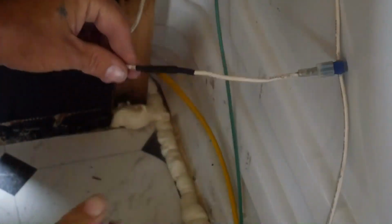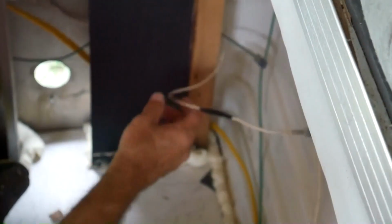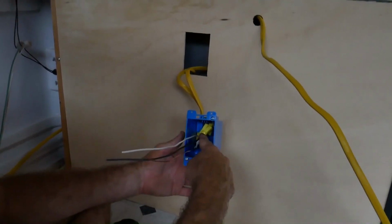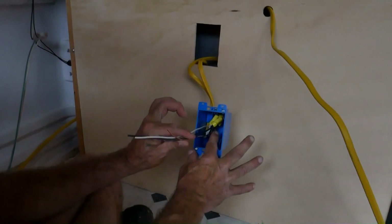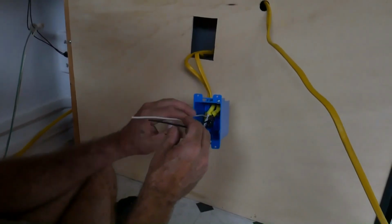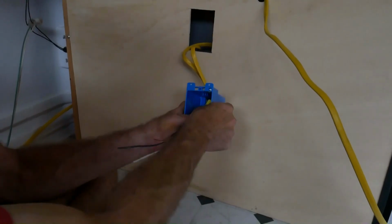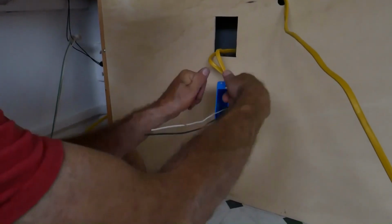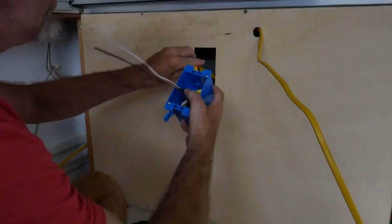So this is a watertight connection? Yes. And outgoing to another receptacle. So the joints are made with pigtails for the receptacle that goes here. Ground, or hot, neutral. And all wires are up and in the back of the box. That way when you make it up, just pop the thing in there. I'm going to pop this in.